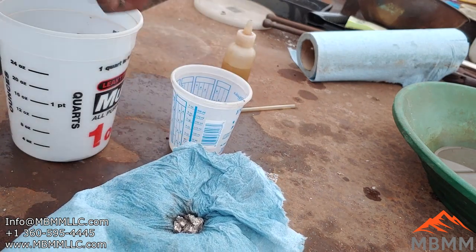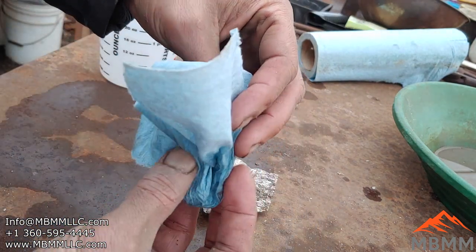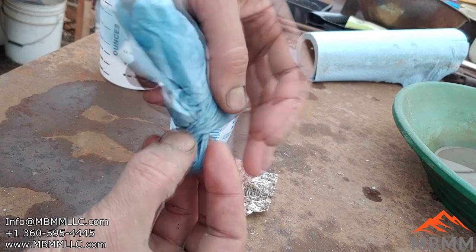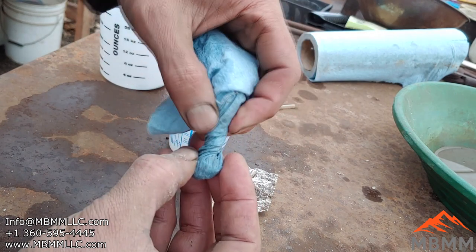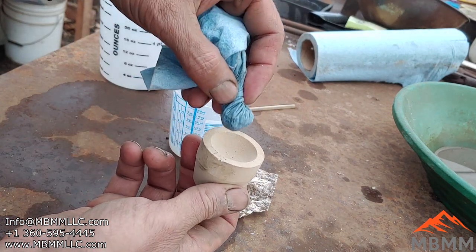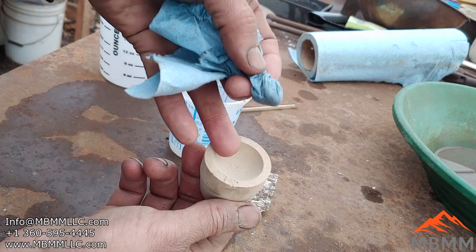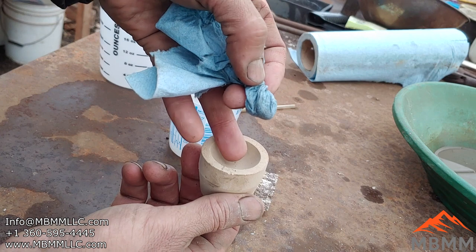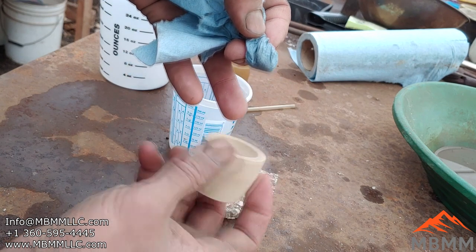And in our furnace, because bismuth is not a precious metal, we're going to get it up real hot, and it's going to start oxidizing. And once the bismuth metal turns to bismuth oxide on the top of the little button, a little bead we're going to make in there, the bismuth oxide will be absorbed by the cupel. This is a cupel. The bismuth oxide is going to get sucked into here, and all the precious metals, the gold and the silver, won't be absorbed into the cupel, so they'll stay as a little gold button on the surface. And when the whole process is done, the gold button will be sitting there solid in the cupel, and the cupel will have turned kind of a dark gray or dark brown color from all the oxides.